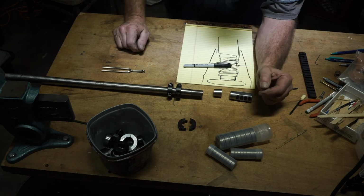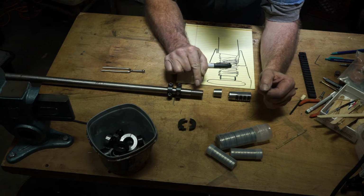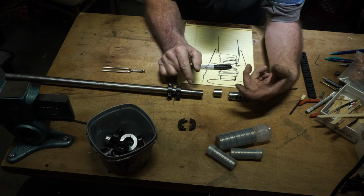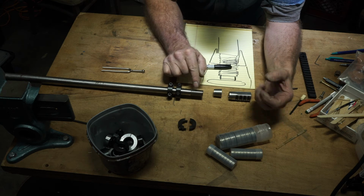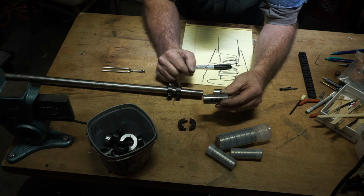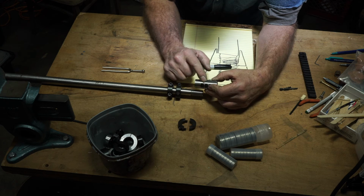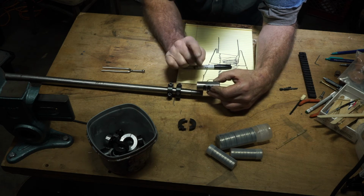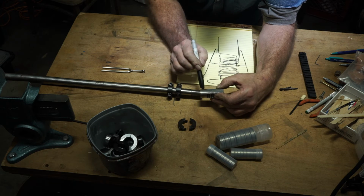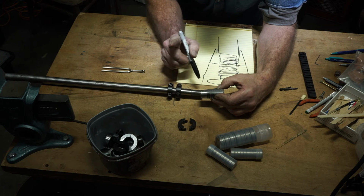And the things that we've got to hold to, the things we've got to work with here on the muzzle brake are select. Now, if we want our muzzle brake to time out correctly, it's really hard to get these shoulders to bury because of thread compression, there's just a ton of reasons why timing a muzzle brake with flats on it is really, really hard in this situation. Even if you're butting in 2 spots, which is the best that you can get, you can absolutely affix a muzzle brake by jamming and cramming up in this area at the end of the muzzle and jamming and cramming back here, provided 2 things.